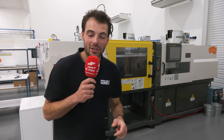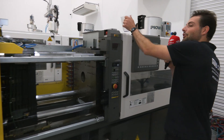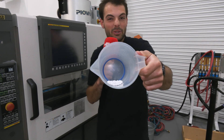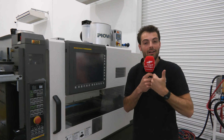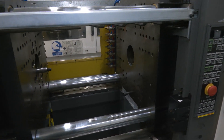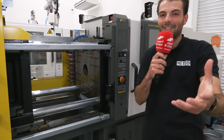The process that hits all of that criteria is called plastic injection moulding, done by machines just like the ones behind me. This machine will inject plastic that starts off in granule form, heat the plastic up to 200 to 300 degrees C, and as it becomes a liquid it's injected into a mould which is pressed together at 1200 bar. The mould is held together with 150 tons — that's almost 50 African elephants.